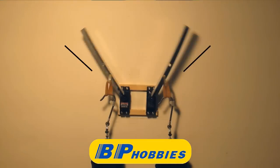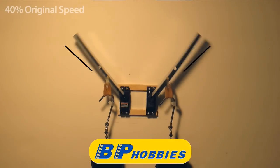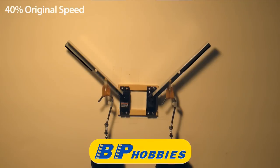We're now going to run the speed and centering test with about 40 ounces on each servo to see if there's a difference. The Hitek servos are actually falling behind on this test, and the Bluebirds are running faster and centering better with the 40 ounces of weight.